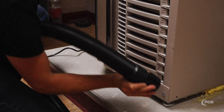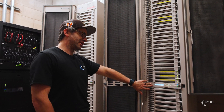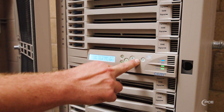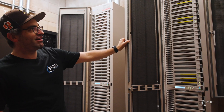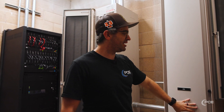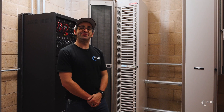When you've finished cleaning your dimmer rack, go back to your dimmer rack control card, go to the menu where it says 'clean your air filter,' hit the check mark, and clear the error. The light will stop blinking at the top if you have no other errors. When it's time to clean your dimmer rack again, the dimmer rack is going to let you know by blinking the beacon light at the top again. And that's how you clean your ETC dimmer rack.